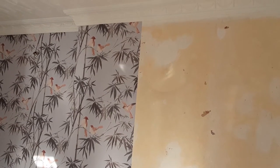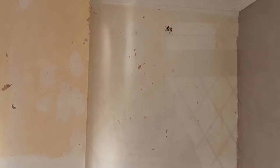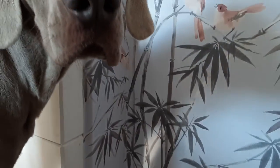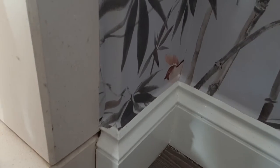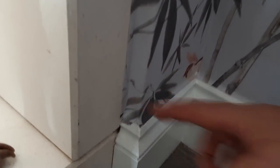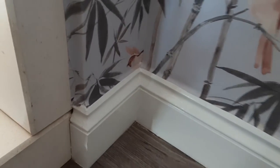Another tip: always have two rolls on the go in case the pattern falls differently, and you can save a small strip to make sure you get to the end with plenty of wallpaper left. With this awkward little bit — if you do cut too much off, you can see that line there — just stick some paper underneath and nobody will know.